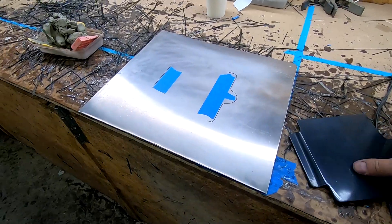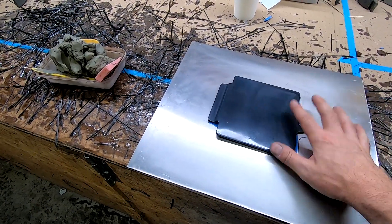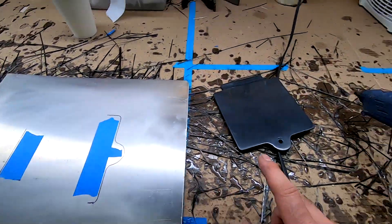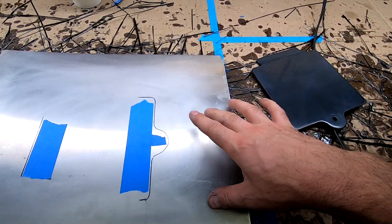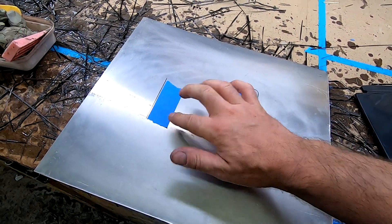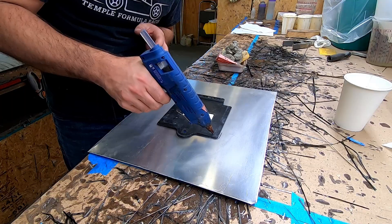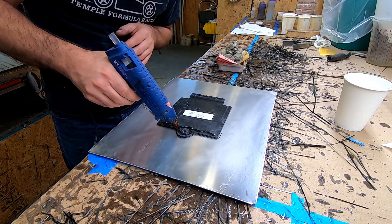Here is what we're going to use as our flange. Because this part is effectively flat, we're just going to put it down on the aluminum. Now a quick tip: hot glue doesn't like to stick to aluminum, so we put some tape down so that the hot glue will stick to the tape, and the tape sticks down to the aluminum much nicer. So what we're going to do is just run some hot glue on the underside of this, stick it down, and then get claying.